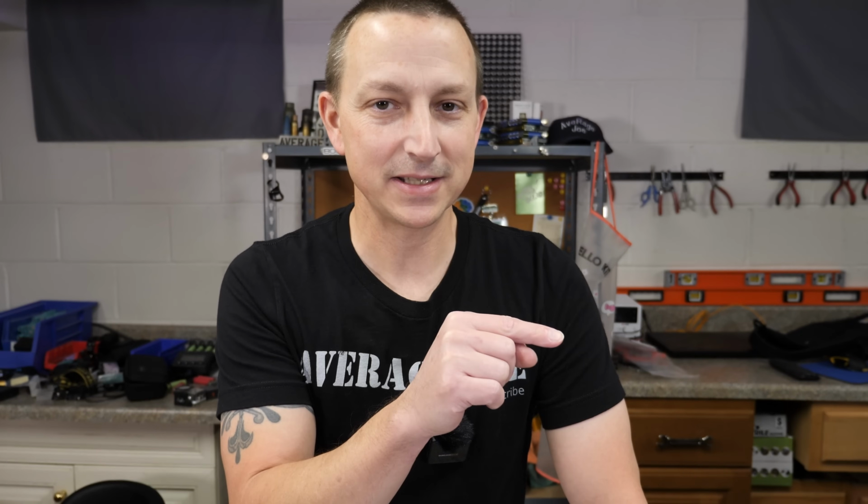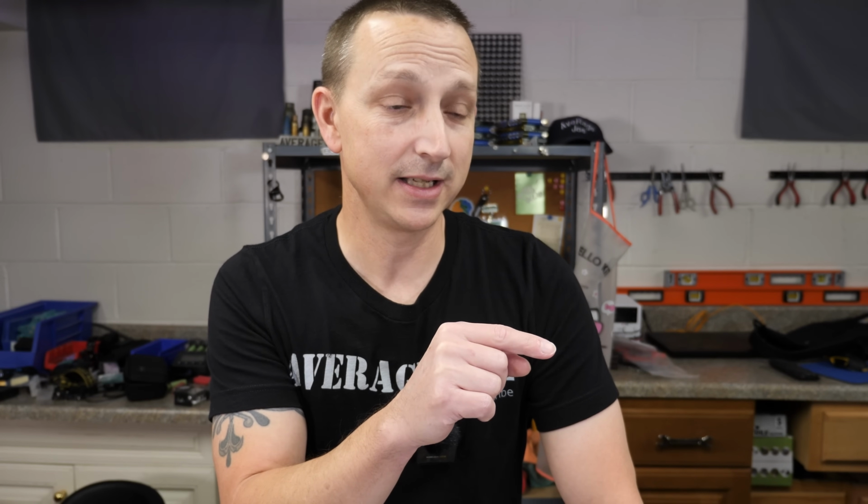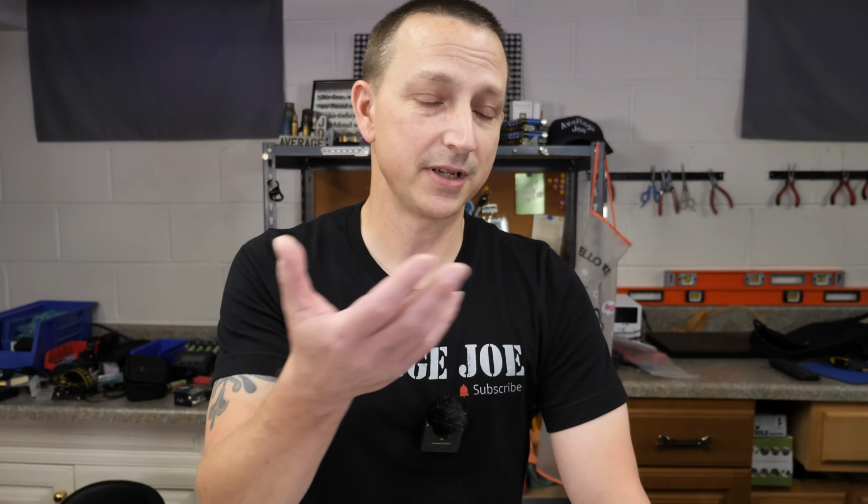However, I have heard that you do need to do a couple of capacity tests on here to basically calibrate the BMS. So I don't know if we need to take that one with a grain of salt or not yet. So basically what I'm gonna do after this video is I'm just gonna start cycle testing this. I'm pretty much gonna use the same 800 watt heater and just cycle it a couple more times and see if we get more capacity out of the battery.